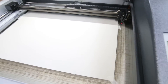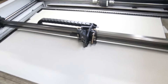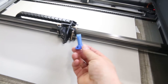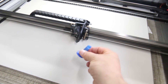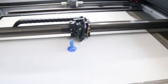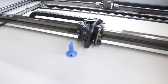Now we go to position the cutting head back to position P2, and we need to use the height setting gauge — this small blue device. This is used to give us a more detailed, more accurate height setting. I need to put the camera on the tripod to demonstrate this, and it's probably going to be from this angle that we get the best view. It's a bit tricky and difficult to see what's going on.